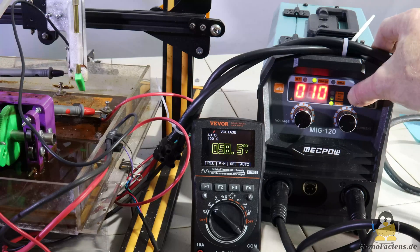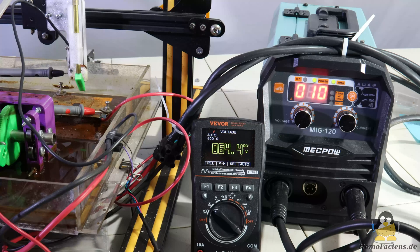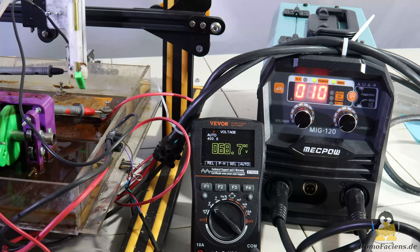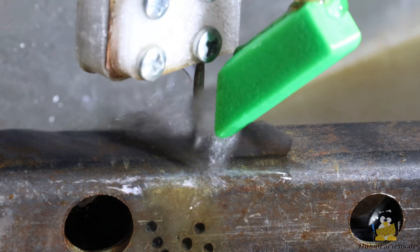When the circuit is open, a direct voltage of 64V is detected across the two output terminals. If the circuit is closed, pulse width modulation ensures that no more than the preselected current flows — the digital multimeter therefore shows a lower voltage of only 0.13V. The welding inverter can therefore be treated as a short-circuit-proof DC voltage source.